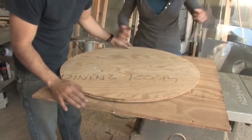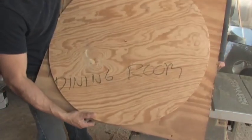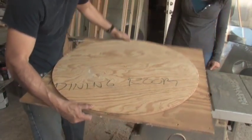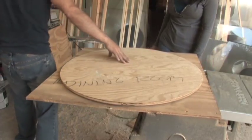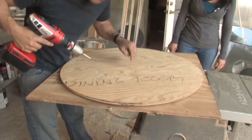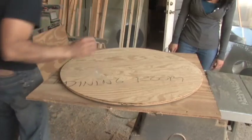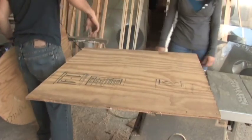No, once you have your first one done, you can basically take the circle. That way, you saw how close I came to that one edge. That was right on, like, another 1/4 inch. And then you just take something, mark your hole, and that's where you're going to drill your center hole. So once you have one done, you can use it as a guide for all the other ones. So we go right there. Smart.